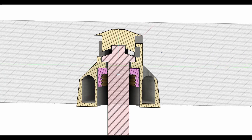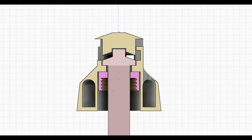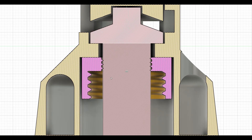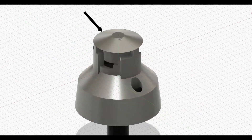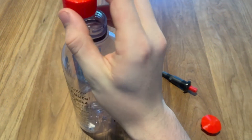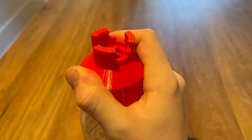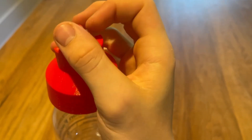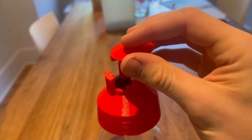The mechanism I built has three parts: a main body that everything mounts onto, a variable sleeve which goes into the main body and allows for different containers to be attached — balloons or differently threaded bottles — and a cap that preloads the spring. Then we screw this onto the bottle, put this on, screw it together, and finish it off with the cap.